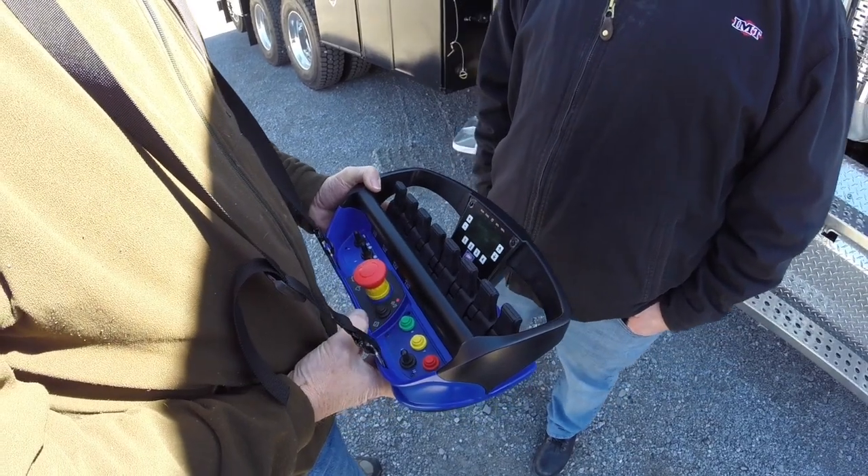The black switch to the left side of the E-stop is your micro switch. If you hit that to the left six times, it's going to derate your speed 60% — not your capacity. Switch it to the right, and one click to the rabbit will be full speed. You do not have to go back six times — once only.